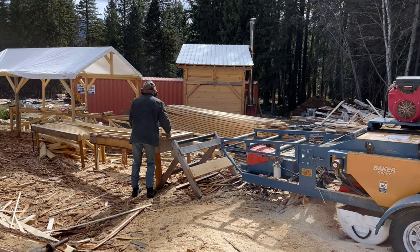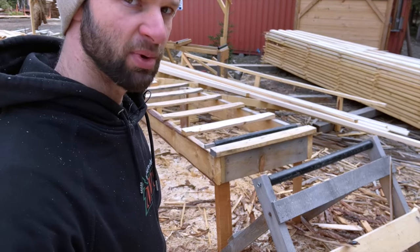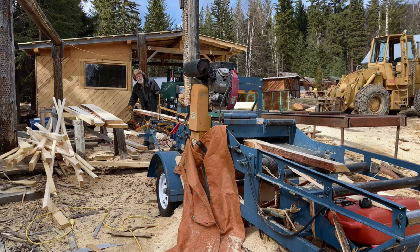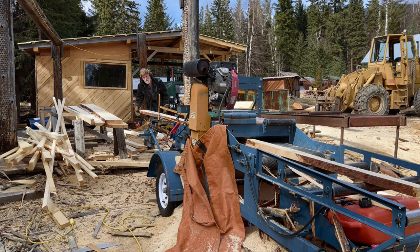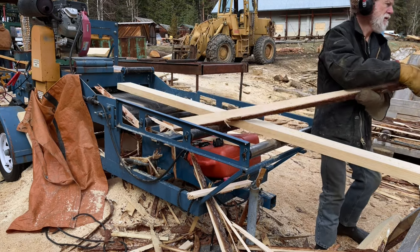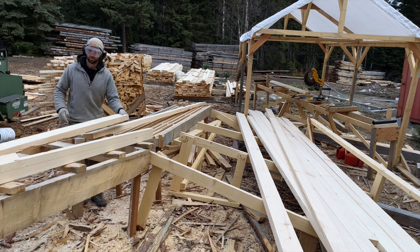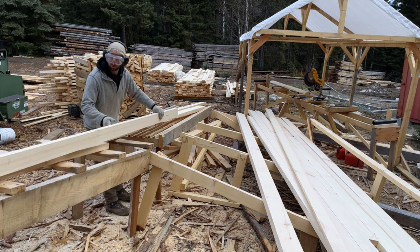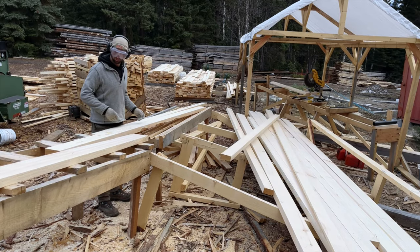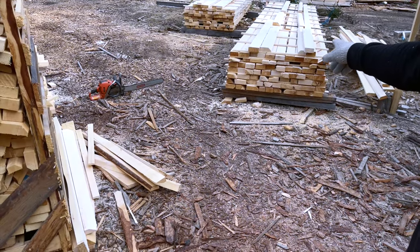Then the good wood, so the wood that's coming through the edger, goes under this little rack system. So I whip this up in a hurry, and it's kind of experimental for me, but it seems to work. The goal is just to get myself further away from the edger. So what I can do is take wood that's coming through the edger and make a decision on whether it's clear, no knots, no defects, and in which case it continues straight through over to our three sorts.